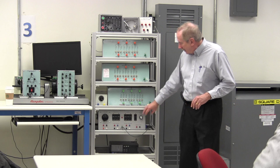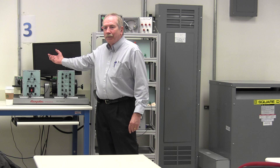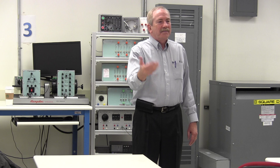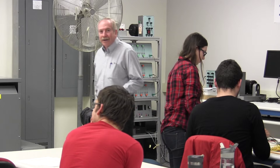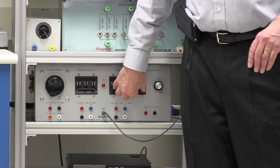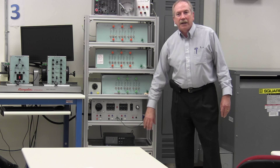Next week in the lab introduction, each one of you is going to learn how to flip this breaker on. We're also going to have you learn how to unplug the whole power supply from the wall — it's a twist and a pull and it's not as easy as it feels, but once you do it you'll remember the motor action. I just want each one of you to physically have done it so that in case something has to happen, you can do it. The control knobs are rheostats — at the end of every experiment and throughout the experiment, I want you to zero them back down so that when you energize, you're not hitting something with voltage. We can crank the voltage up gradually.